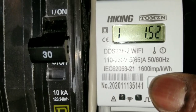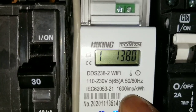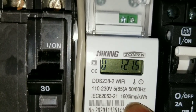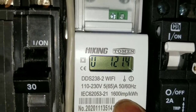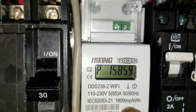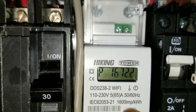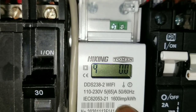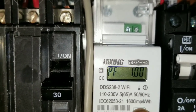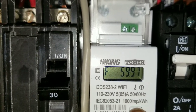We figured it out. The I is the current and we're pulling 13 amps. I have the tea kettle, the freezer, and the fridge running. The voltage U says 121.5 volts — you can hear the kettle in the background. The P, which is the power in watts, is pulling about 1600 watts. The power factor is 1.0 and the frequency is 59.99, going to 60 hertz.